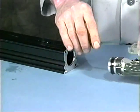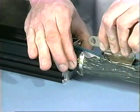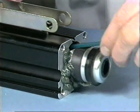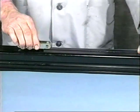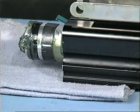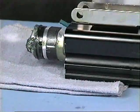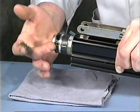Feed one end of the sealing band down the piston ramp through the bracket while moving the piston bracket assembly into the tube, again using your fingers to guide the U-cup into the bore. Make sure the sealing band does not catch on the lip of the wear ring on the opposite end of the piston. Slide the piston assembly the length of the tube, stopping as the end of the piston exits the tube bore. This will seat the sealing band in its groove.